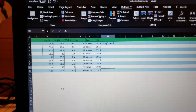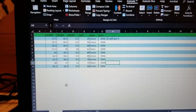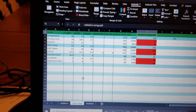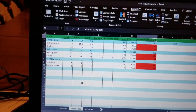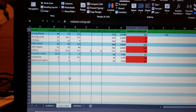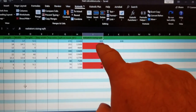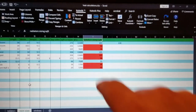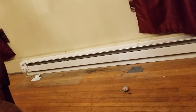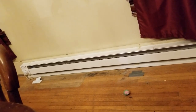I know that one radiator is going to be huge — probably two radiators in that room; I think it's always been undersized. It also depends on how I handle the hall, because it's a big open space and it's going to take a lot of heat. The old timers put one radiator at the bottom of the stairs and one at the top — the one at the top wasn't very big because all the heat rises up. Once you've calculated the square footage you need, you can figure out how big a radiator you need to fit the spots already roughed in by the previous installers.